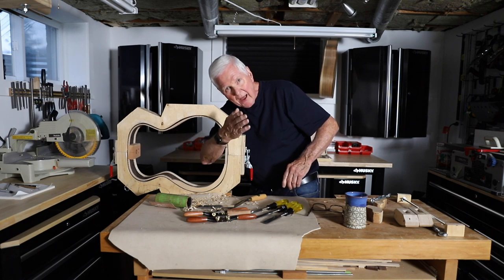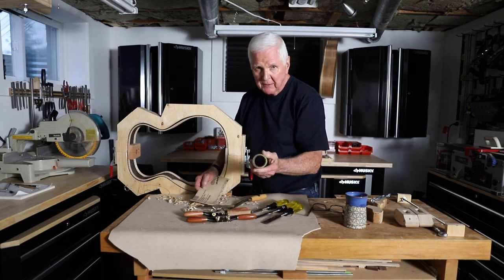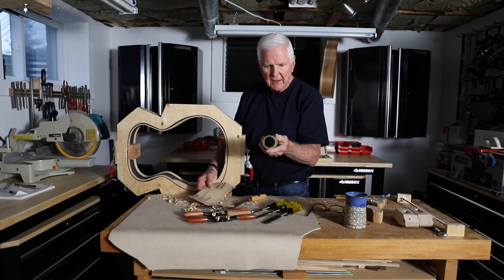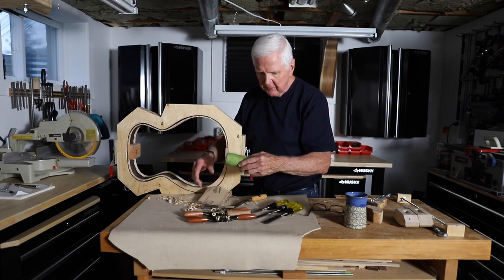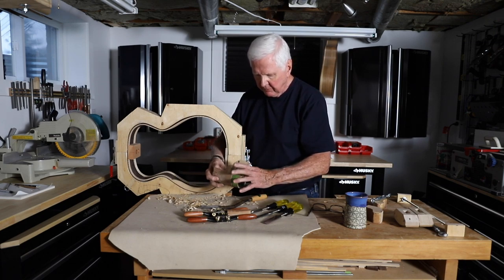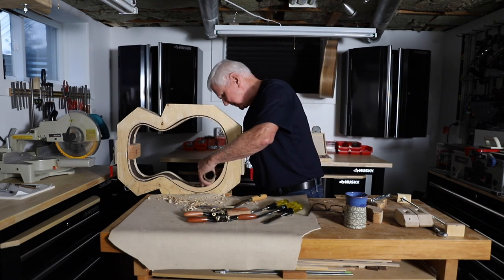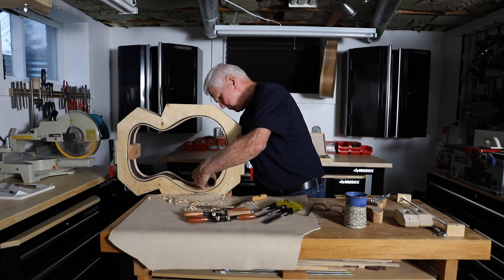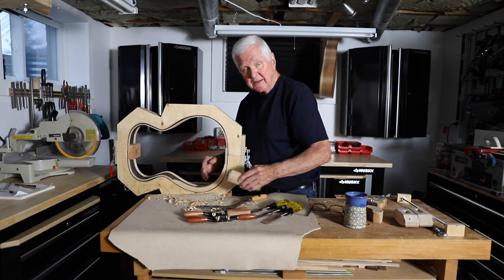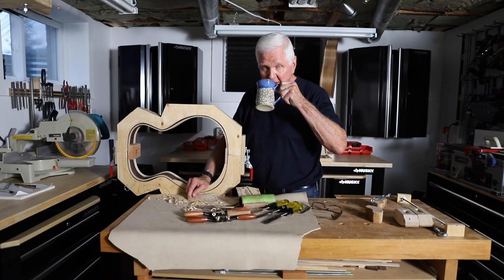To get that nice round, smooth curve coming right around, I made a tool: a one-and-a-half-inch piece of PVC pipe with some towel wrapped around it, then covered with tape so it's somewhat soft. I take a piece of sandpaper, roll it onto this, and just let my wrist roll it back and forth. I don't do too much of this here though because — with the camera equipment nearby — getting dust on it would be a definite no-no.